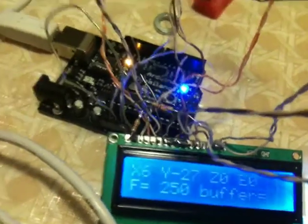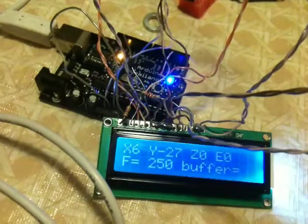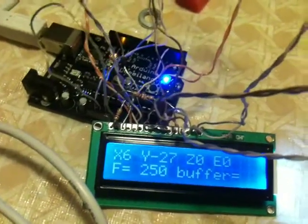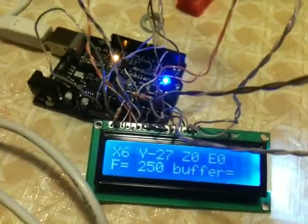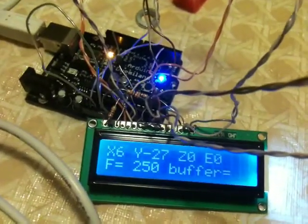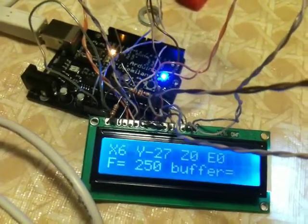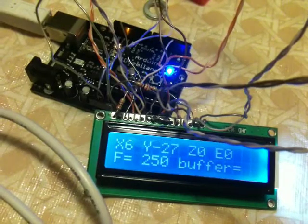It's not communicating with me very well, or it's not working the way I wanted it to right now, but it's enough to show you that it's coming. It's still a ways to work. This uses six pins of the Arduino for the LCD. Only one of those pins needs to be an unused pin, which is pin 19.